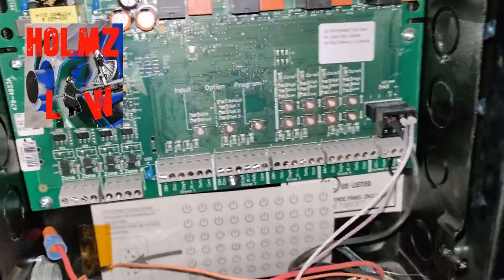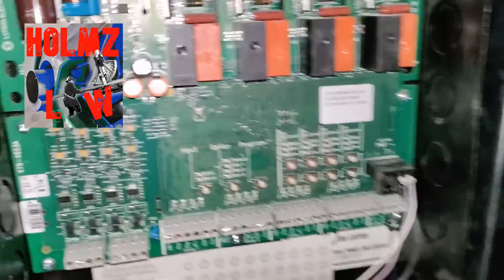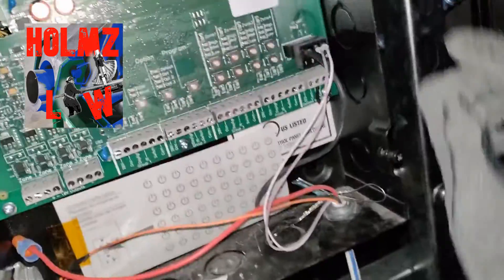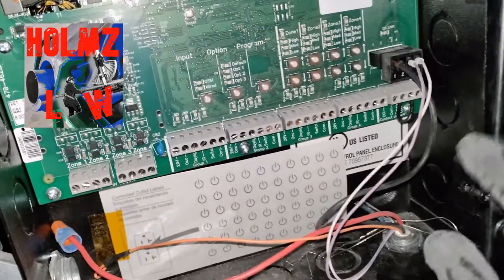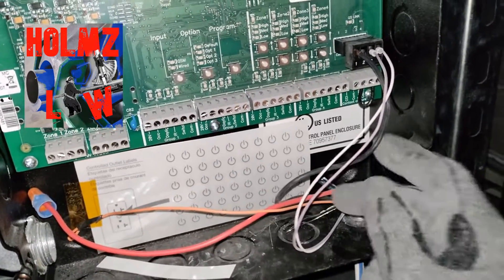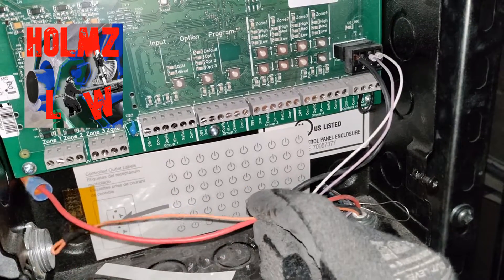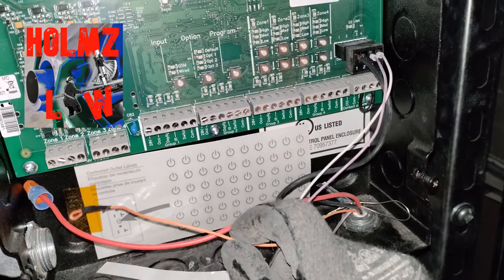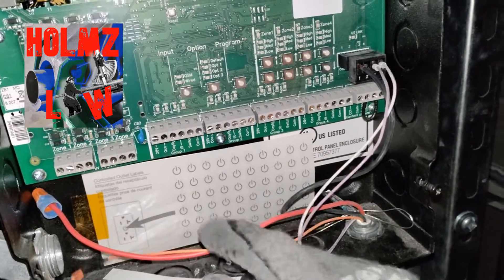Getting down here in the control part, you have your QS link, which is basically just a regular low voltage wire. It has five cables in there. One of them is going to be a 22 gauge, two of them are going to be 22 gauge, and then you have two 12 gauges, and I believe this is like a 16 gauge or whatnot — it's for another device, another Lutron device.